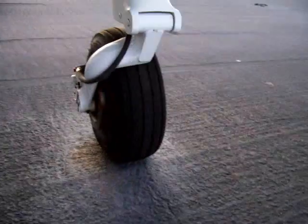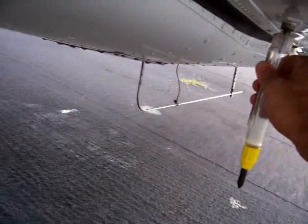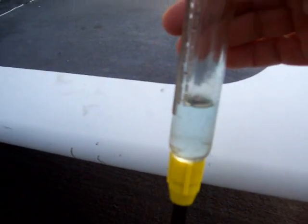Tire and brakes look good. No leaks on the ground, tread looks good. Fuel sump — go ahead and fuel sump this thing here. What I'm looking for is blue — that's blue in there, slight tint of blue. There's no debris, no bubbles. That's poured on the ground — the EPA I know has a fit, but oh well, we're in Mississippi.